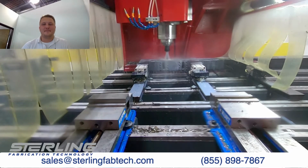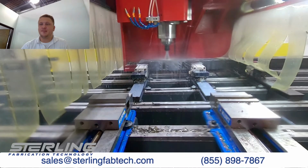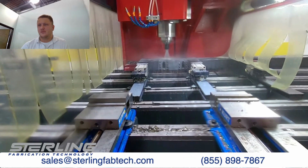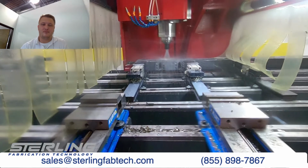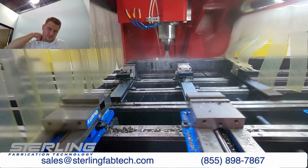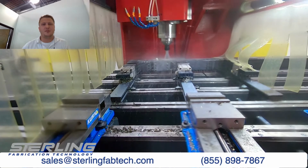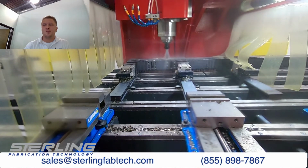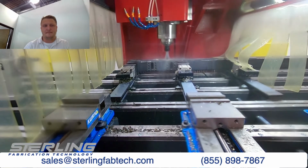And so while we got the spindle moving here, what are we seeing? What are we looking at here, Aaron? So here I got a 9/16 carbide drill that we're just drilling some holes in. And then after this, I'm going to bring in a 1/2-inch solid carbide end mill to contour ramp the slots on the tube here. Now, one more question. So with us using this type of operation, is there a reason why we chose this type of fixturing for this specific operation? For this particular part, it was just more or less the length of the part.